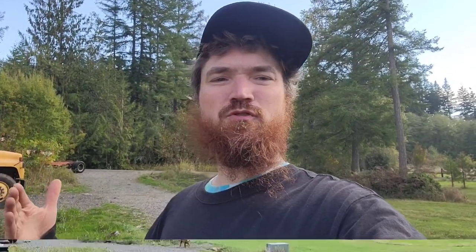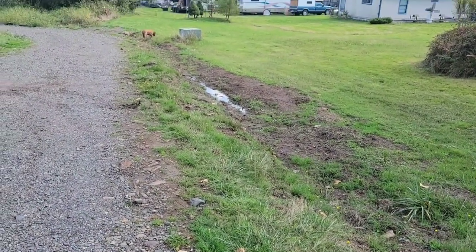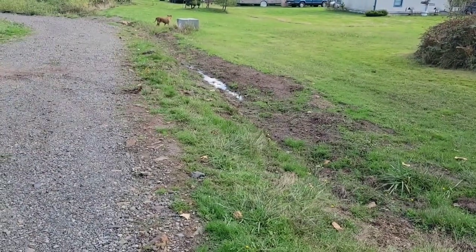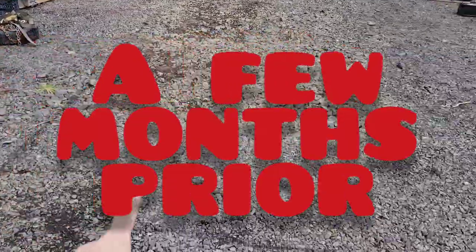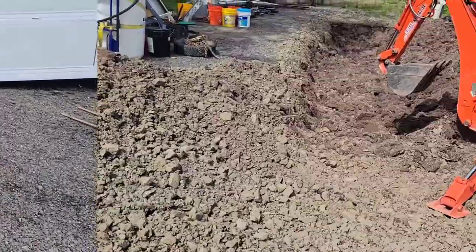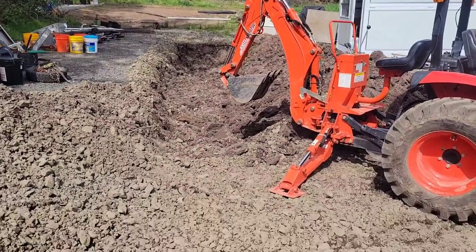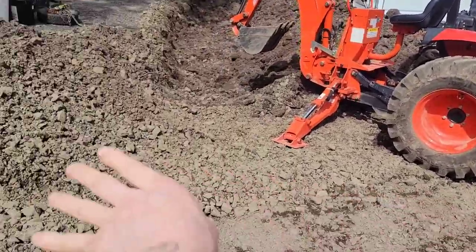I told you guys when I did this ditch and left it kind of jagged and funky that I'd come back in the summer and backtrack it — and I did. I just didn't feel like it was video-worthy. You just drive up with your tractor, put your bucket down, back up, and scrape along the edges to make a better V shape. After that I started spray-painting on the gravel a rough outline of where I needed to drag the gravel off and level down. Put the bucket on this morning and started back-dragging, pulling most of my gravel off and pushing it into piles.